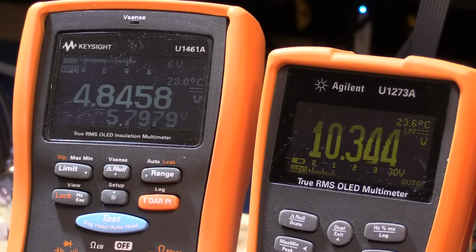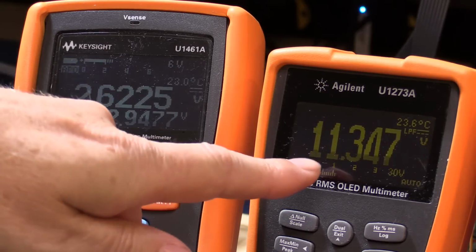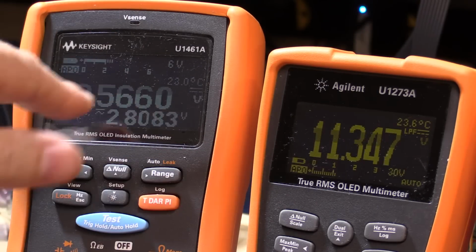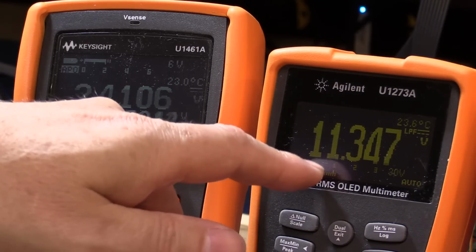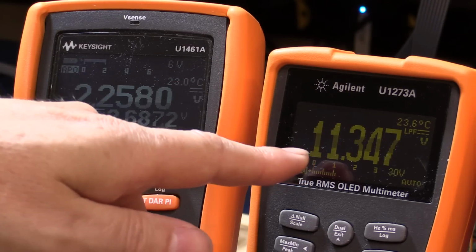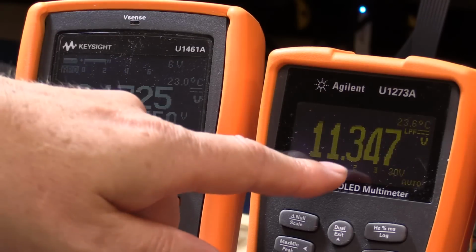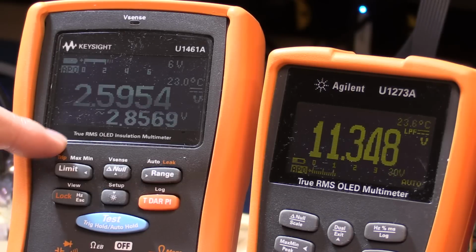If I increase the current limit again, back up right there, now it's stopped. You see this one is the voltage reading and it's now saying, hey, I don't care anymore, the current limiting has overloaded it. The voltage is actually technically trying to push the MOSFET harder on, so it's gone up to its top rail of 11.3 volts. It's a 12 volt supply, less a little bit in the op amp. So it's pushed as high as it can, and the current is now taking control.